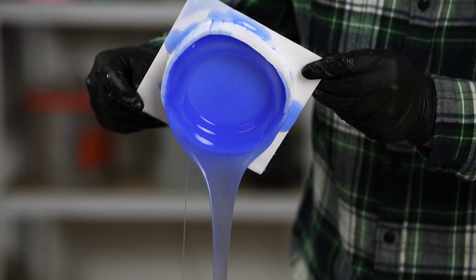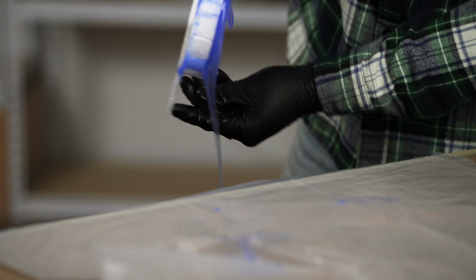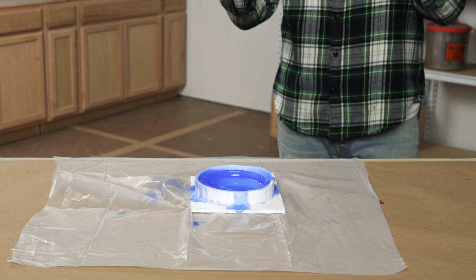If we don't have the time or patience for that, we can dump our silicone out of our mold and into a clean bucket. With the remaining open time, we can do our best to fix the leaking area before pouring our silicone back into our mold. However, this isn't a foolproof method and does require a good amount of remaining open time to work.